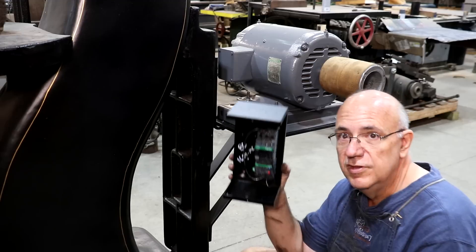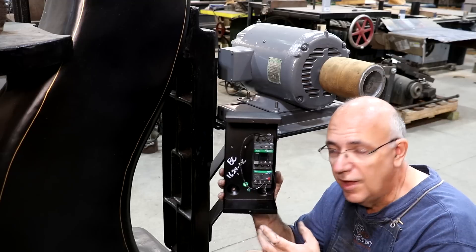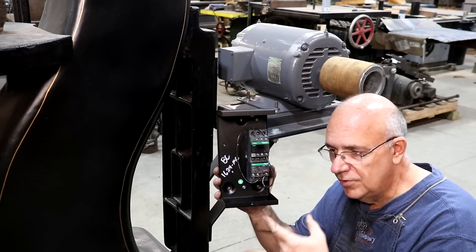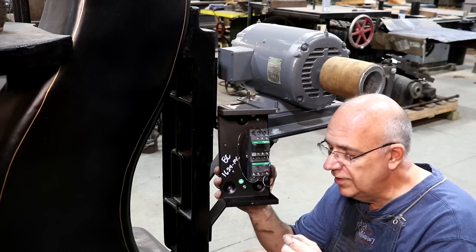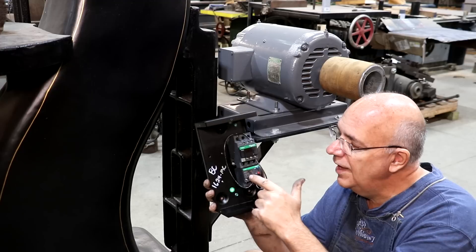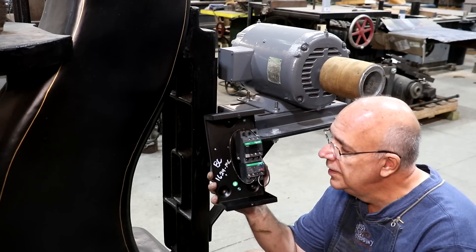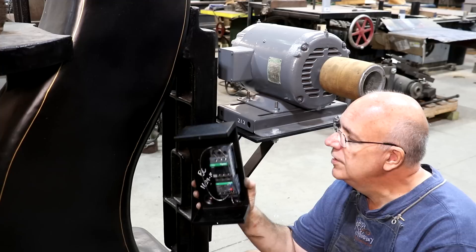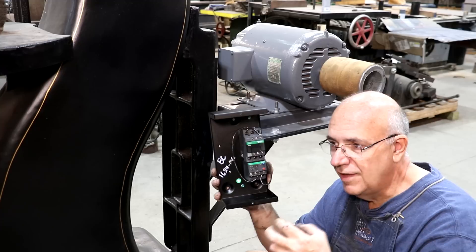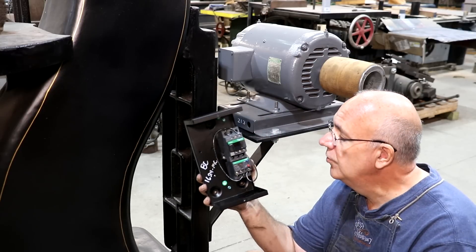The motor starter we're going to use is a modern style motor starter. This is a little bit different than the older styles, which are a little bit bigger. For overload protection on the older styles, they had heaters — basically just little strips of metal that were a certain thickness and gauge, and they would heat up whenever it started drawing that many amps and it would mechanically kick it out. This has got a little bit different setup — you can actually just adjust it. There's a dial on here for how many amps you want your protection set for. This is a NEMA size one motor starter. On the old ones you'd have to change those heaters out and order the right size. This, you just dial it in. We've got 22 amps on the low end there, so we're good.